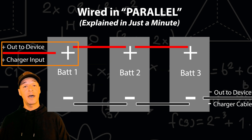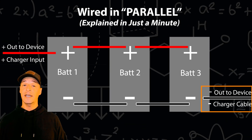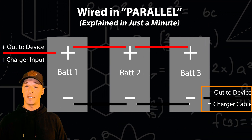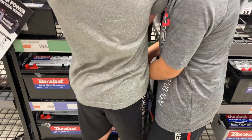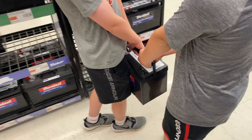Make sure you connect your devices to batteries at either end of the system — don't hook them to the same battery. Hook the positive to your battery all the way at one end and your negative to the battery all the way at the opposite end. This is really going to help your batteries draw, wear, and charge more evenly. When you've selected your batteries and go to make your purchase, make sure you have a hopefully free labor force to help you carry them — things are heavy.